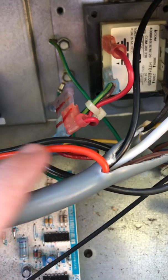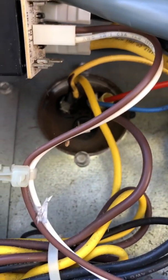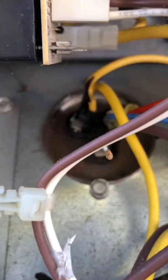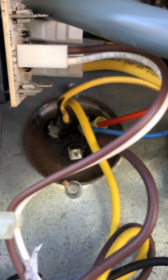We'll start with the orange wire. The orange wire is going to be put on to the terminal on the H on the capacitor. Your capacitor might be a big round thing like this — under here there's a big round part of the canister. There's an H, an F, and a C, and the H is the compressor.